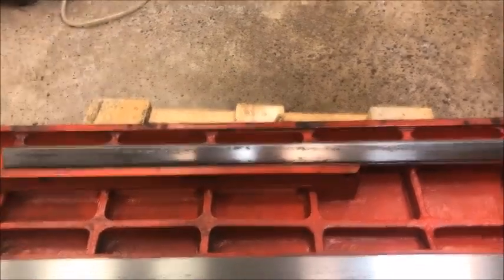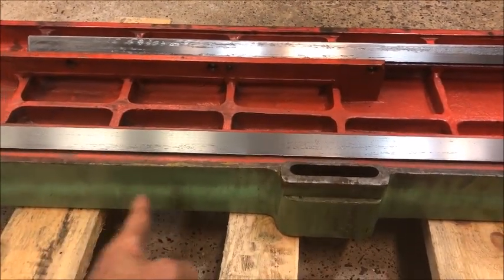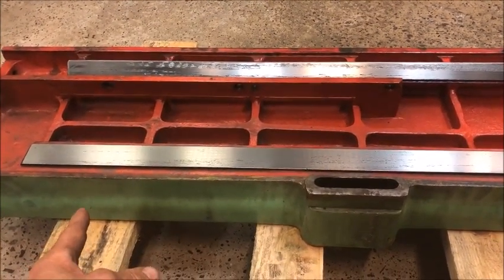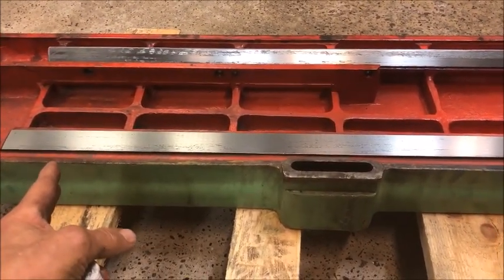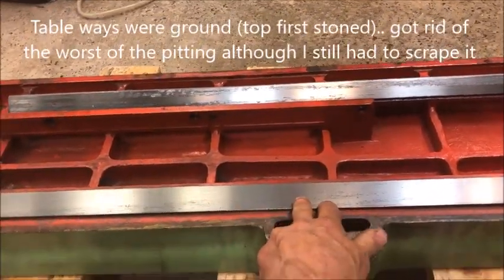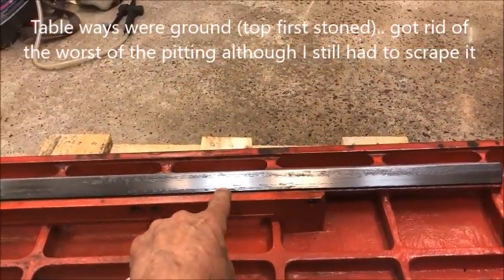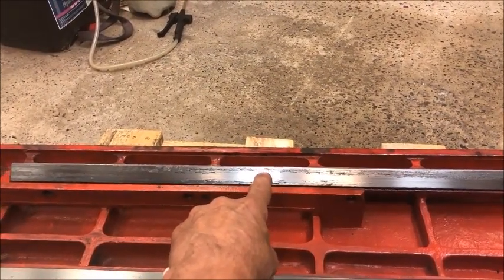And the way to grind it was that I put it on the area points first, and then measured, and then of course skimmed the whole table. Put it onto the magnet, then ground. We ground this one first, so that we ensure that this was flat at the top of the table. And then the same operation, just dressed by 45 degrees on the wheel.